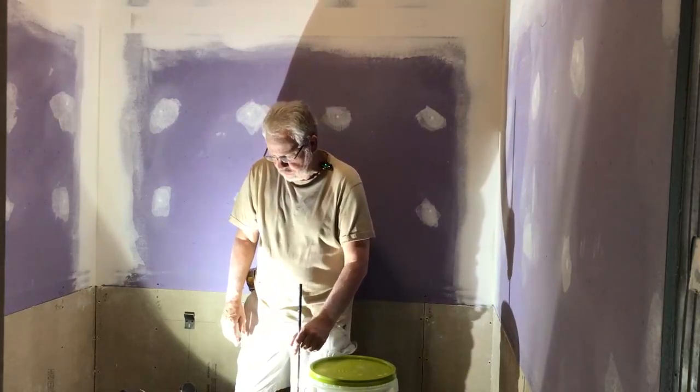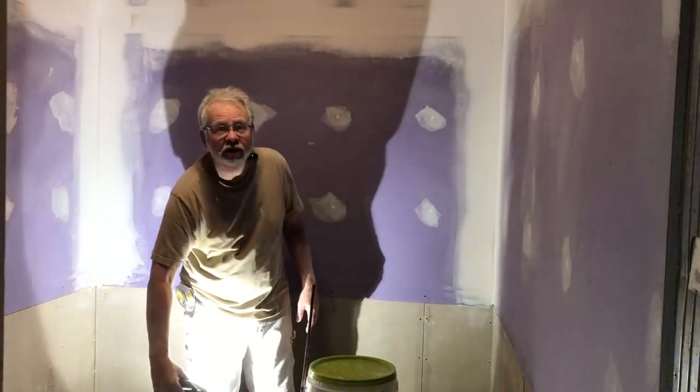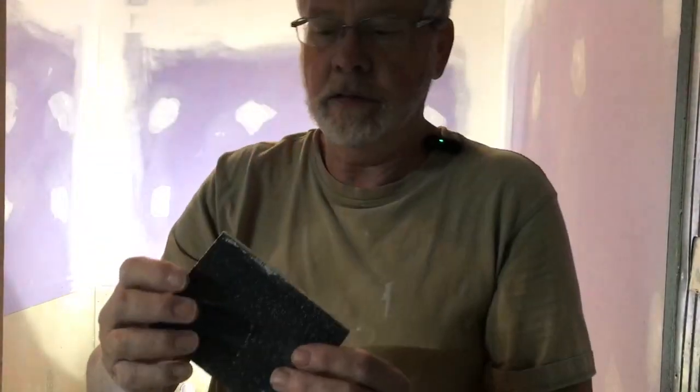As you're sanding your walls, it does help to have a portable light so you can look right up the wall. One thing I always say is that your fingers can feel a whole lot more than your eyes can see — run your hands over it and you'll find rough spots you didn't detect. You think you have everything perfect and then you put the paint on and it's like 'where did that come from?' I suggest using 3M sanding blocks — they've got a square side and a point so they're easy to get into places, easy to handle, do a nice job, and are relatively inexpensive.